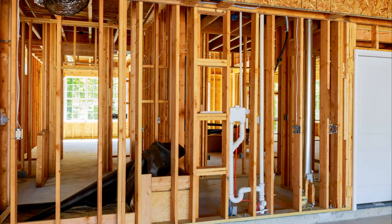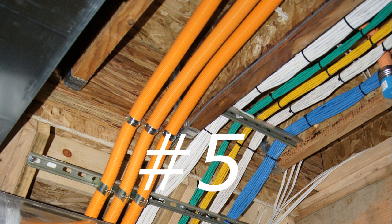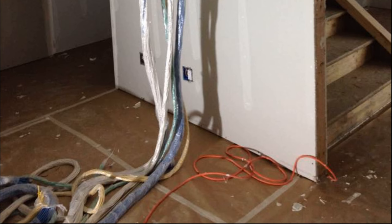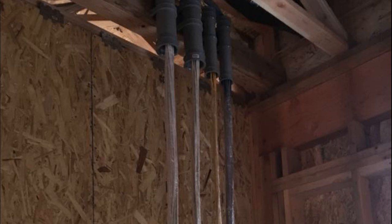The fifth mistake is about your rough-in wiring. We go into home theaters and don't see the right wire run — we're still seeing lamp cord and 18-gauge wire. Maybe 18-gauge will work for some architectural speakers, but if you have big power-hungry speakers you're going to need something more robust. Our rule of thumb: anything architectural or higher-end — like a Focal — we're going to run at a minimum 16-2 or 14-2 speaker wire.